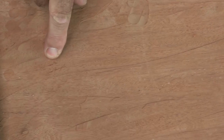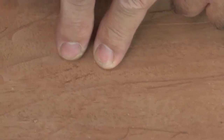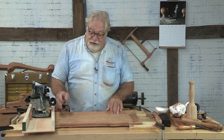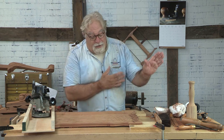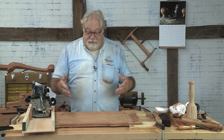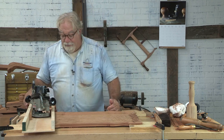Here's an example of that. I'll be able to take care of this with the skim cut. But if I had tried to go right down to the final surface with, say, a quarter of an inch remaining, I very likely might have clipped one of those little islands left over, and in blowing it out of the way, I would have pulled up grain deeper into my table top. So this is another reason for taking this final, very slight cut to get down to where we want to be.